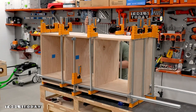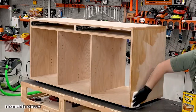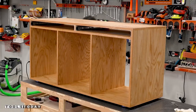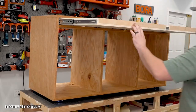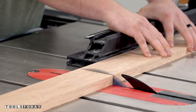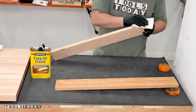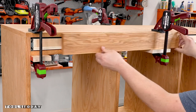After letting the glue dry overnight I removed the clamps and began applying finish. I'm using tung oil as it's a really easy finish to apply and maintain for shop furniture. Off camera I made two short drawers to fit in the cart to store small commonly used items in the shop — I ripped some red oak to size and crosscut it to length to act as the drawer fronts. With those all cut I applied finish to the drawer fronts and top of the cart. Red oak tends to be a wood many people aren't fond of but I absolutely love it — after making the panorouter cart project I decided I needed to use red oak more in shop projects. I love the color that comes out when finish is applied.